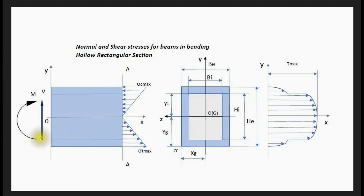Considering the shear forces: these are resisted by stresses acting parallel to any cross section through the beam. The magnitude is zero at the top and bottom, rising to a maximum in the center. The contribution to shear resistance from the top and bottom flanges is almost negligible — by far the biggest contribution comes from the two webs, and in practice you normally just design the webs to resist the total shear force.